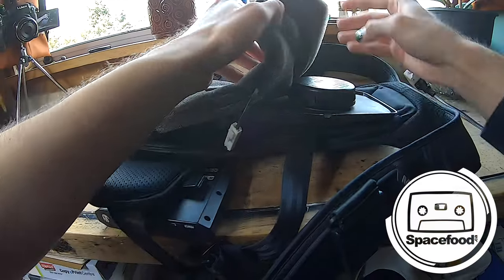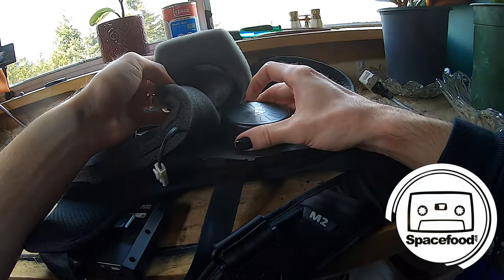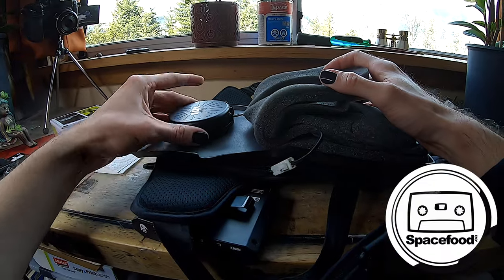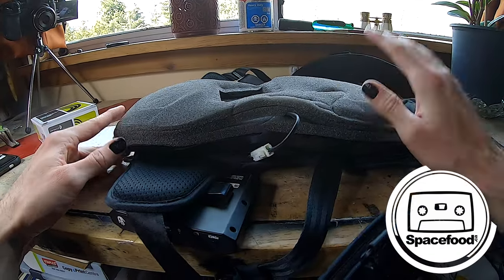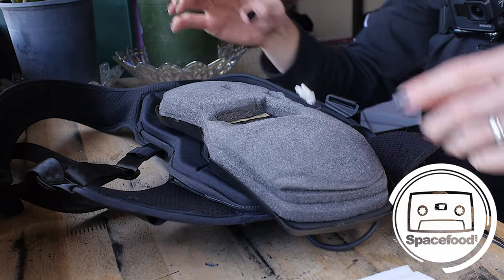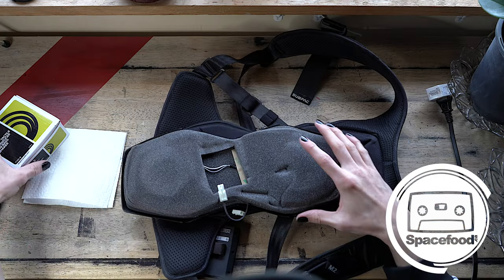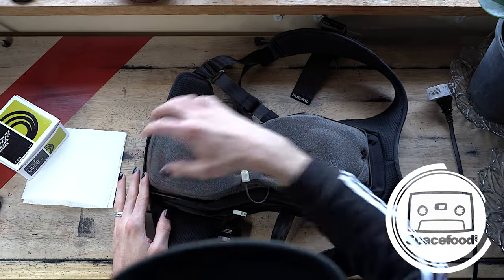When you open it up here, you'll see there's a sub shaker here, and there's also a sub shaker here too. So the first thing I'm going to do is just disconnect this little clasp, and that'll give me a little bit more control while I'm pulling this apart. I'm also going to test these transducers before I actually really start tearing this apart.